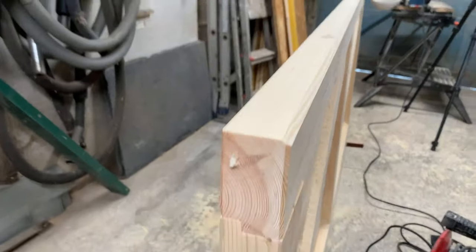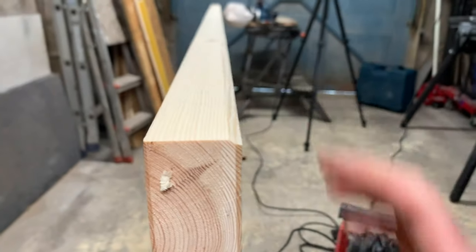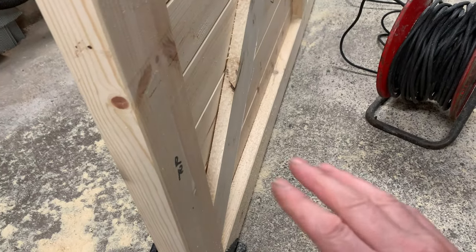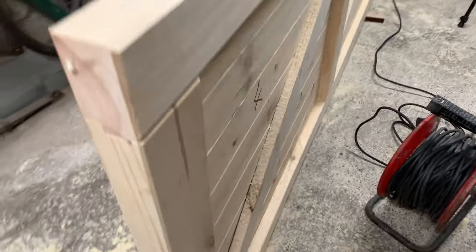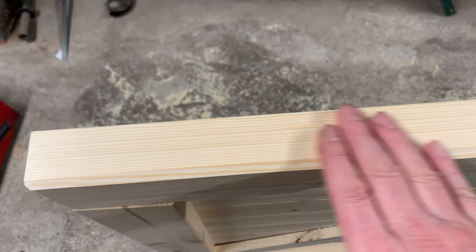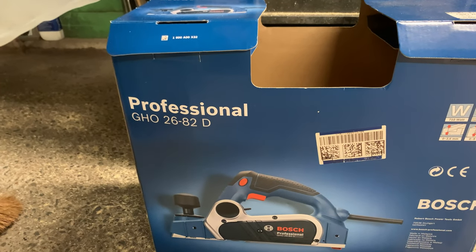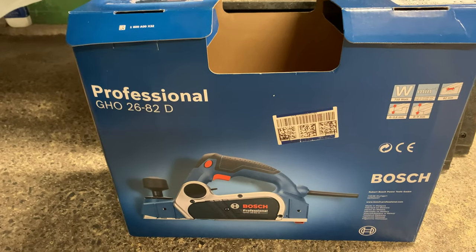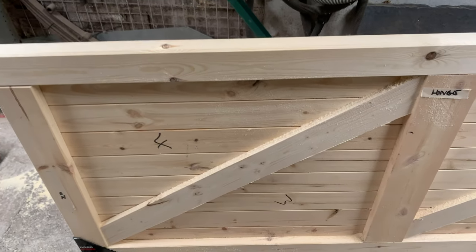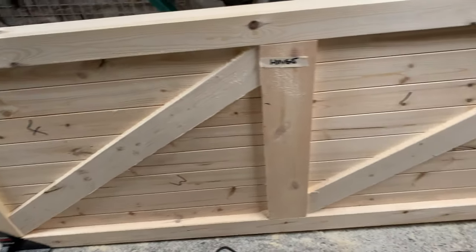Let's have a look at the bevel and see how it came out. It was set to 2mm and I didn't change the depth of cut, so we've effectively got a 2mm bevel there — and it's not bad at all, that's just what I was looking for. I'll do the same on the other side: two more passes of 2mm to take the full width down, then a couple more bevels and the door's done. Lovely finish — you'd expect that from a good quality tool with a brand new blade. I'm very happy with it. That's the Bosch Professional GHO 2682D on test. Hope you found it useful — thumbs up if you did, and links including the manual and where I bought it from Amazon are all in the description. Thanks for watching.